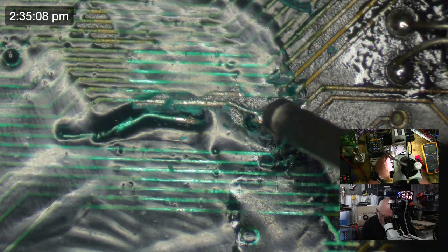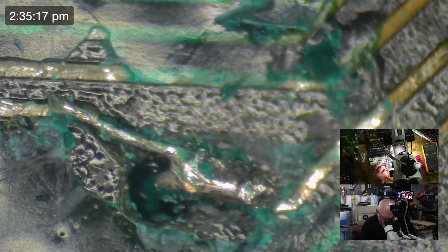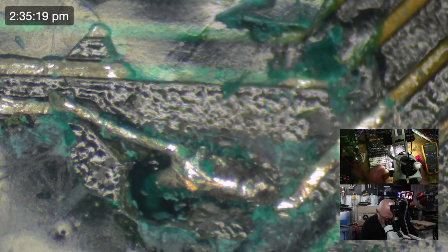Yeah, it's very, very flaky. Let's have a look. This joint here is not good. When I push this, I lose continuity on it. So we don't have a proper join there.